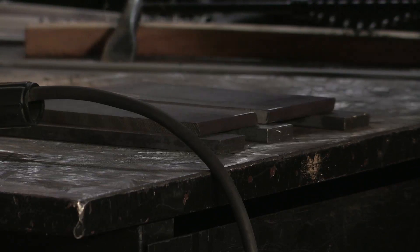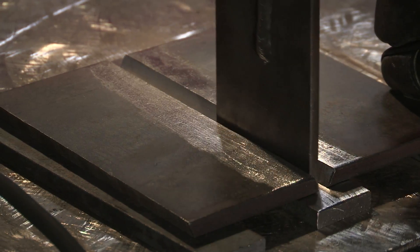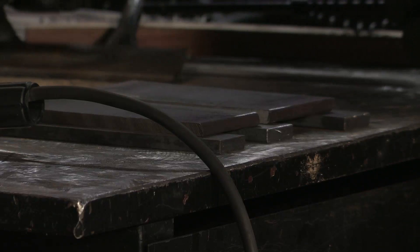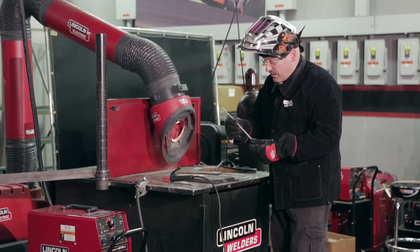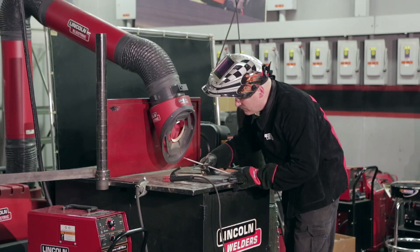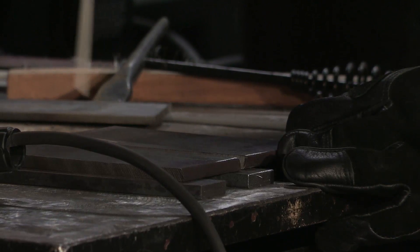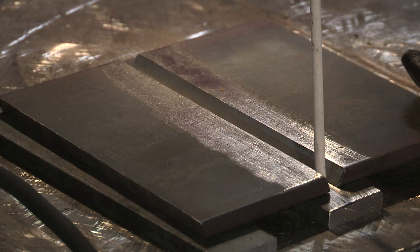I kind of gauge this actually by eye, but I can use this quarter inch thick plate and kind of stick it down in there and give it just a little wiggle — not that much wiggle, just a little wiggle. I like to have a little bit of room in there. I'm going to be using Excalibur 7018, one-eighth rod to make this test, and I like to make sure that rod can wiggle just a little bit there. Just a little bit of room for the gap, and that should be just a little over a quarter and a little under 5/16. If it's too tight I'm not going to have room to wet those sides in real good.